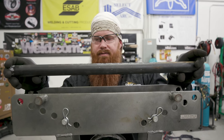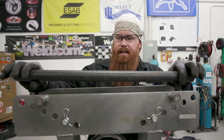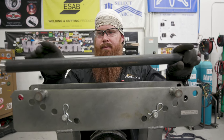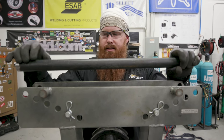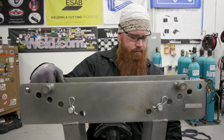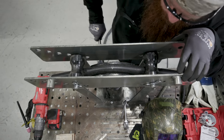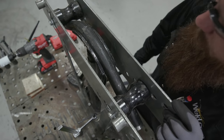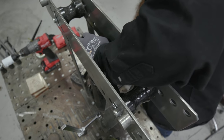I have about a 24-inch piece of one-inch pipe right here — it's about an inch and a quarter OD and one-inch ID. I'm going to bend this into a 90-degree angle because once it's done it's going to be kind of like a bird shape. We're going to put little feet on here and that'll be his beak. So now I've got this bent roughly about 90 — it doesn't have to be perfect, especially for what it's going to be.